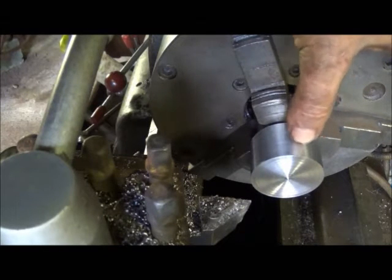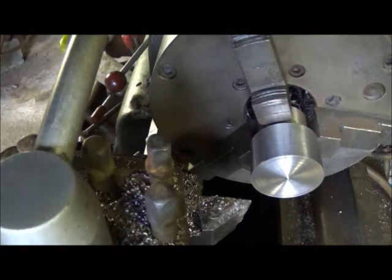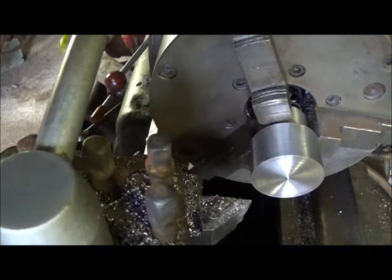And this is not as important as what that is. So that's going to give us our offset on our bearings, and we want them all to be the same. And then we can shim them as we need to. But we'll go 350 exactly on that, and I'll get that knocked out and I'll show you more.